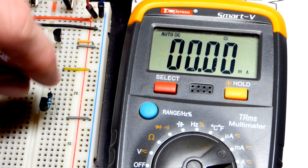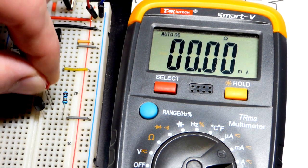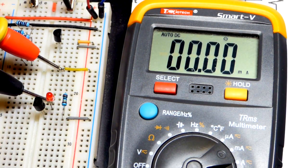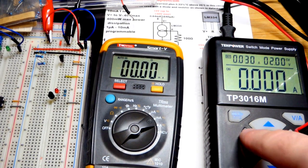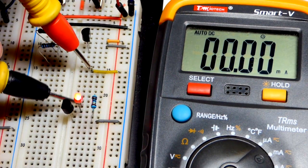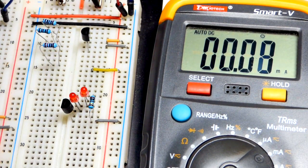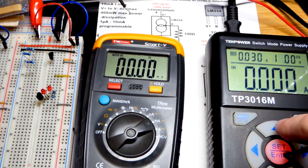Now we're going to add an LED because the current does not depend on the load. The component wants to allow a set amount of current based on the resistor. At 2 volts we fall short — the LED isn't even letting anything conduct. So we're going to raise the voltage. With one LED I need at least 4 volts, and with additional LEDs in series adding more voltage demand, I'll jump right up to 12 volts to accommodate 4 LEDs in series — some of them green, which block a little more voltage.